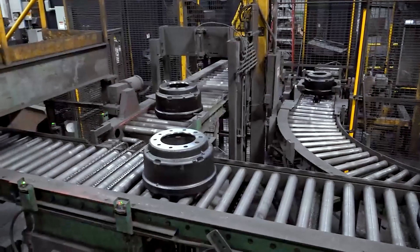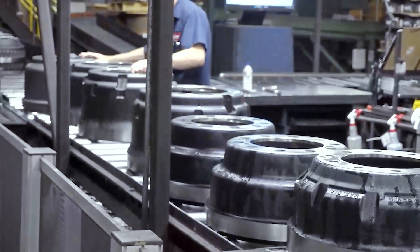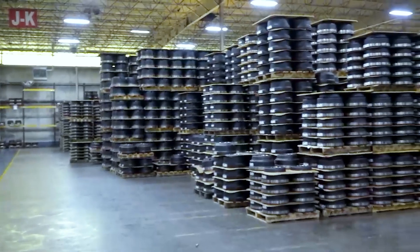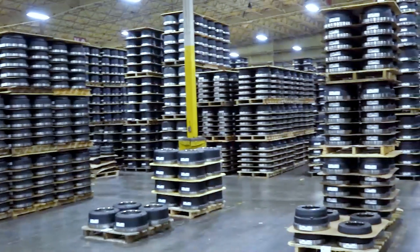After machining, the parts are put on a central conveyor and go to our inspection station. All of our drums pass through an inspection station for visual checks on both the foundry side and the machining side to make sure everything meets blueprint specifications. After that, we go into balancing. We've recently installed our first balancing cell that will incorporate the BT-650. After balancing, they're moved to the finished product side where finished labels are put on and then they move to the warehouse. With the cycle times and throughput capacity of these 650s, we're getting product to the warehouse ready to ship in about 45 minutes on this mid-volume line.